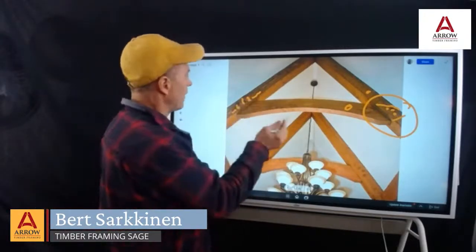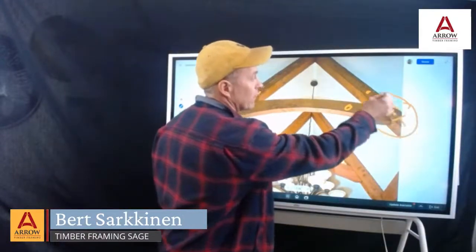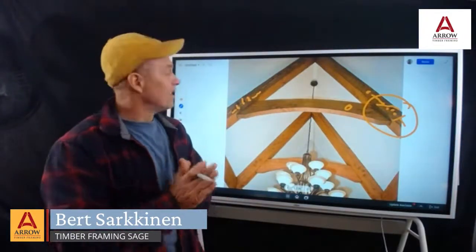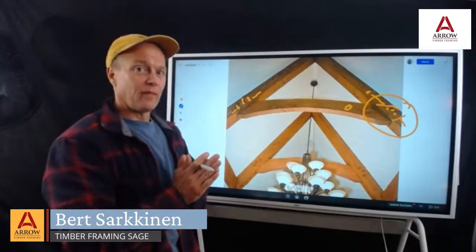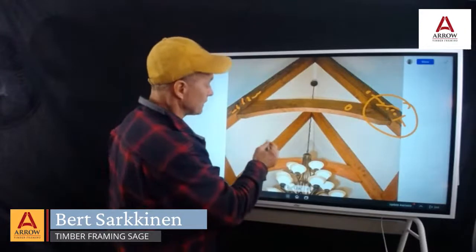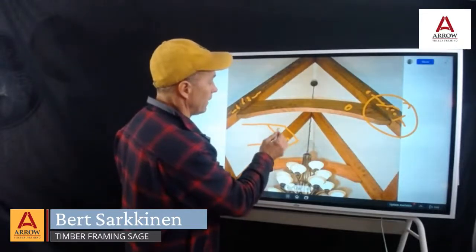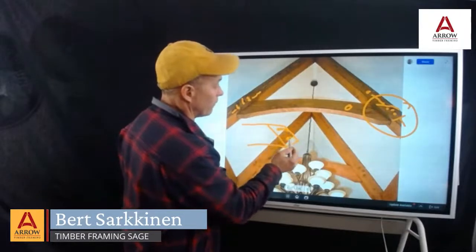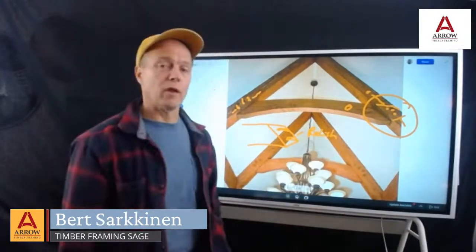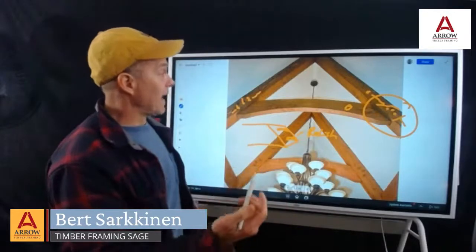So the pegs are in the center, and another reason why it's in the center and not towards the end, where the perpendicular to grain is going to be your weakest point, is because of a concept known as hot dogs or relish. So relish is a timber framing term that refers to the wood behind the peg that would have to pull out for a joint to fail. So in this case, if our tenon looks like this here, if we have a peg and a peg, the relish is that wood that's going to fail, and that's parallel to grain. This is the relish. If you want to picture the peg as the hot dog for a memory hook, be my guest. The relish is the wood that's going to fail, and typically having it centered makes sense.